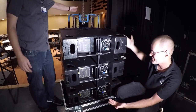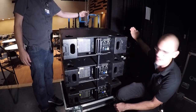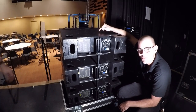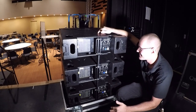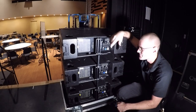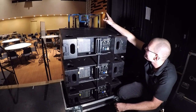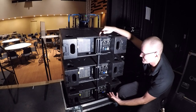They come nicely in a box like this. They're all adjusted to be completely flat, which is not how we'll want it for the show. Depending on which ballroom you're in, there's a book upstairs that tells you what angles to put these guys at. They're already calculated for the room so we can get the best coverage. For today, we're going to get them hooked up to the chain fall first, then we'll adjust the angles, and then we'll power these suckers up.